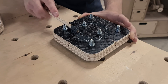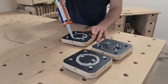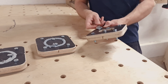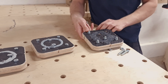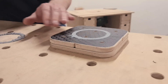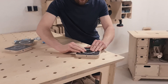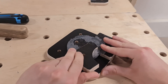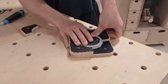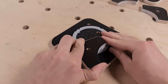I have to be careful to ensure the sealant fills the whole mold for the wheel to be nice and smooth. I make sure to mark each mold to keep track of the sealants used. After waiting two days it was time to take apart the mold. But again it's easier said than done, and removing the mold parts didn't go as easily as planned. I managed to remove some of the mold corners, however it damaged the tires a little bit. While taking a break I started to read the tubing labels and realized that most of the sealants could be used as glue — no wonder I couldn't take apart the molds.